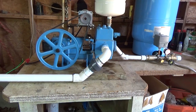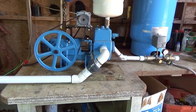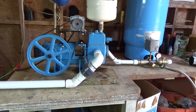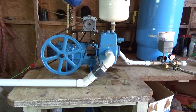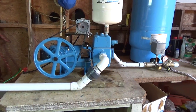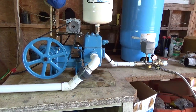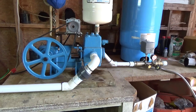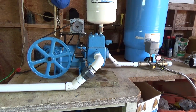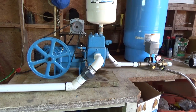I've finished rebuilding the old piston pump and I've got it hooked to a bladder tank. It's also plumbed to my rain catchment system outside, so I'm able to take my rainwater and boost it up. I actually boosted it up to 90 PSI — I just wanted to see where the motor would stall out or the belt would slip — much higher than I'd ever need it to be.